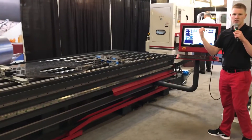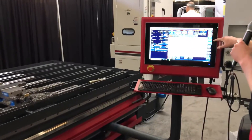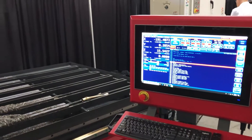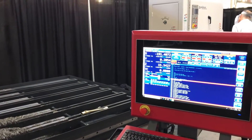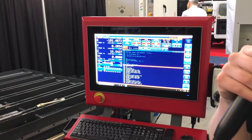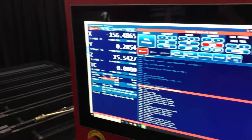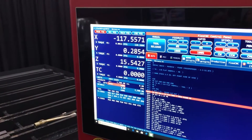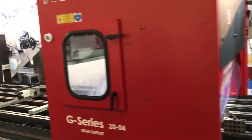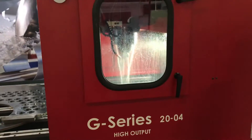Come on in and get a look at the new next-gen controller. The FlexCNC equipped with the Delta Tau control has a couple of really unique features, one being called indefinite look ahead, which allows it to look ahead into the program and be intuitive as far as what kind of motion control is necessary for that specific part.